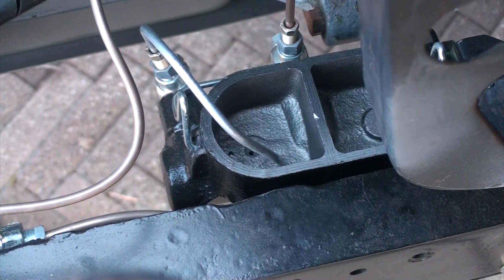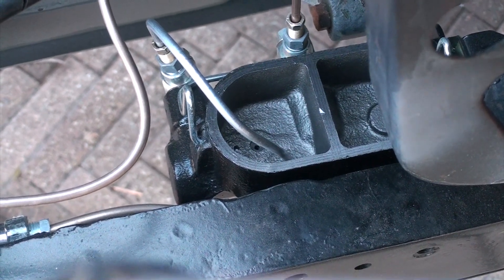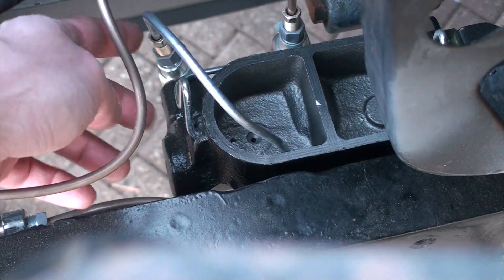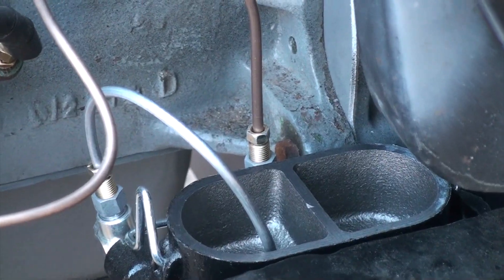Some people say you need clear line to see the bubbles come out, but you don't. You just have to pump the fluid through, and any bubbles that are coming out you're going to see them at the bottom of this line — you don't need to see them flowing. I'll put a link in the description with the tools that I used.